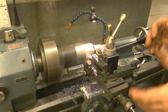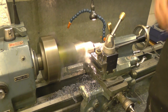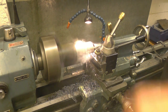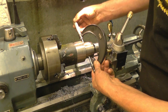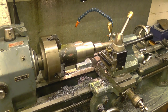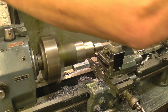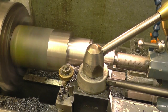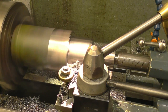It's starting to get near the size now — over by 20 to 25 thou — so I'm trying different speeds and feeds to see what sort of finish I can get. I'm going to watch the temperature as well because temperature makes a big difference to the finished dimension. I think there's four thou to come off. I'll speed the lathe up and do another pass on the same setting, then do a light finishing pass.